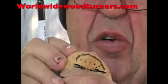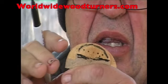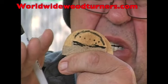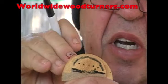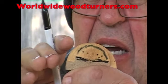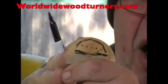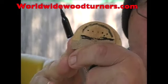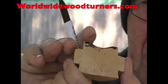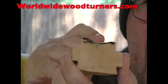And that's real critical to me because when the piece I'm turning moves, and that's going to happen, the piece is going to move, and this moves, and that's going to happen too. If they don't move exactly alike, it'll crack or break off. And then you'll end up with a weak holding glue block. So the profile is, we've put a little dish, and we have a little shoulder, and that can be any shape you want. That's not important.